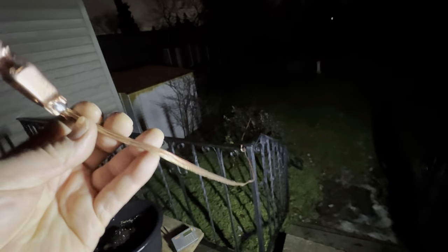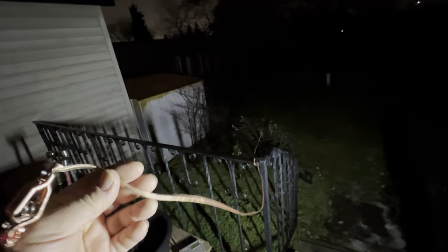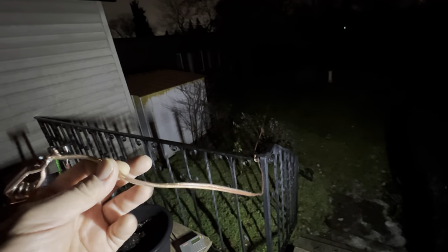On the other end, I just want to let everybody know: if you're going to do this, keep your antenna insulated, especially on the other end. If you have it hooked up to a building or something metal, you want to insulate your antenna, because if you ground the antenna to whatever structure it is, you can actually detune the antenna and your reception will not be that great.